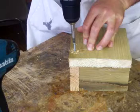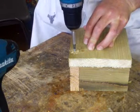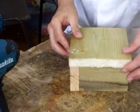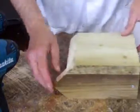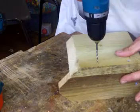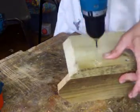When you're driving your screw in, if you get to the end, if you pulse it like this, that stops the screwdriver slipping out of the slot. I reckon you want a couple of screws to the length.